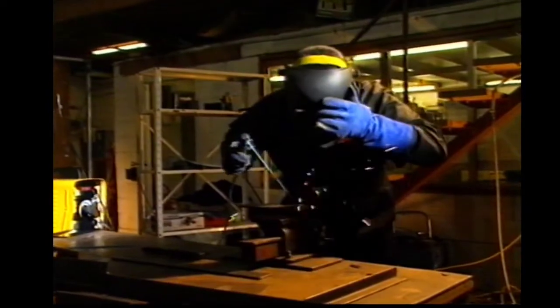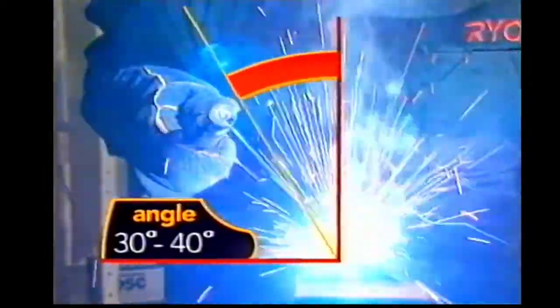Having checked your chart and set up your machine, you're ready to weld, and your aim is to do a good job. Welding is about fusing metal together — if you don't get the correct fusion, you won't get a strong weld. You strike the arc, the exciting moment in welding, which simply means you strike the metal with the electrode. Ease the electrode about 1 millimetre away from the job, and with the electrode 30 to 40 degrees to the job, you run it drawing from left to right. The weld is made by feeding the electrode into the molten pool and moving the electrode along the joint at that 30 to 40 degree angle at a speed needed to deposit the required size of weld.